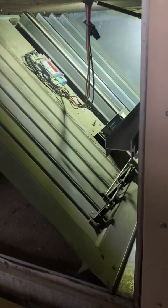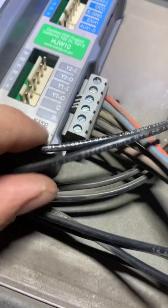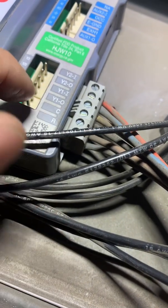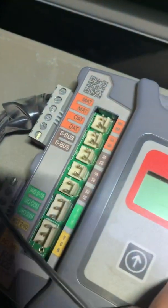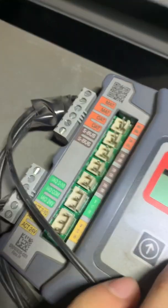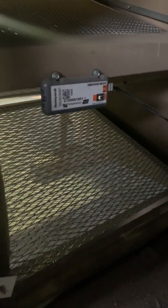So I pull new wire. The only wires I don't pull new from the unit are the constant 24-volt. All damper motors have a TR and TR1, which is almost always constant 24 — and that's what I use for R and C. But if you're already pulling wire, just go ahead and pull a six-wire and replace all of these. For the outdoor air sensor and mixed air sensor, I usually always pull new wire in case there's an issue. It's quite simple — just two wires go in for each sensor.